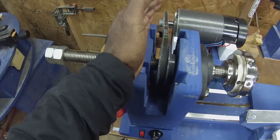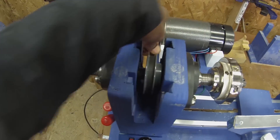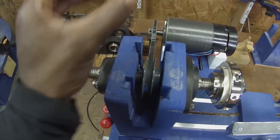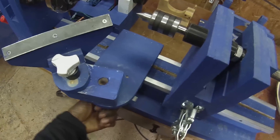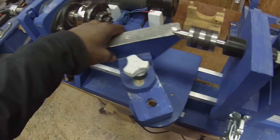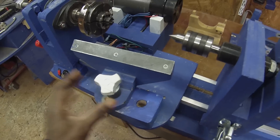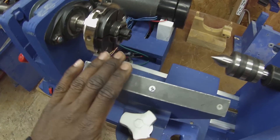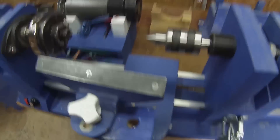Right here you can see this space is pretty narrow. I knew by that point I was going to be using this DC motor with the speed controller, so I really only left enough space to get one pulley in there. But in the new plans, it'll be wide enough to put three pulleys and some locking nuts in there to keep the pulleys from sliding around. This design is okay, but I'm really wanting this part to be adjustable. There have been several times where I was working on a piece and wanted it just a tiny bit lower or higher, and there's no adjustment in this. So the new tool rest will be adjustable.